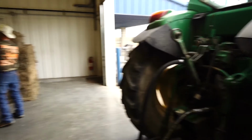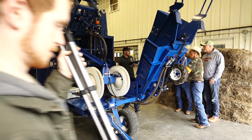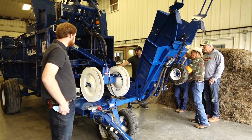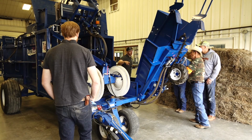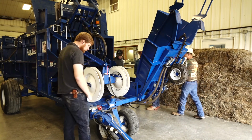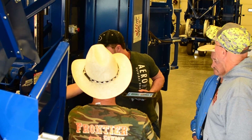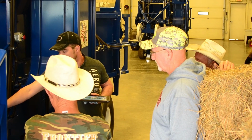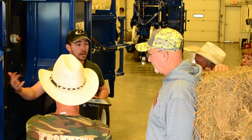All right, so at this point, that's the best e-stop you're going to get. I really don't want this running while I'm talking, so I'm going to manipulate this, but check here. If I add pressure to that, 3,000 PSI, and of course valves bleed a little bit, it's dropping back down to 29, 28, whatever. So that's what that tractor's putting out. It's putting out a full 3,000 PSI.